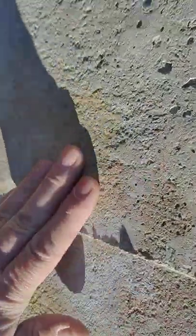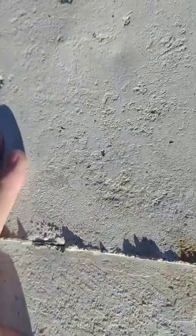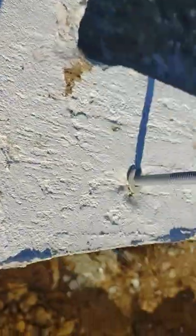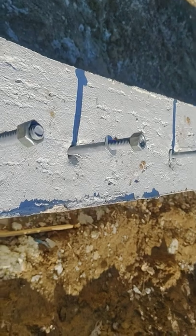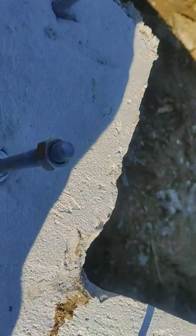This is a newly poured concrete — you can see there are not a lot of air bubbles, especially as you go down. You achieve this only with a concrete vibrator. Otherwise you will have little air pockets left behind, like this one, which will degrade the quality of the concrete. Alright, thanks for watching, bye bye.